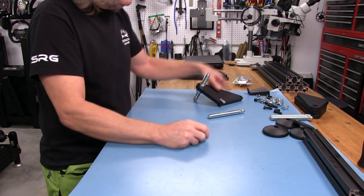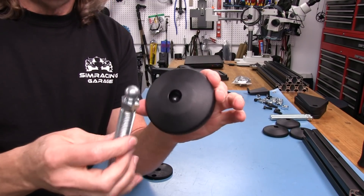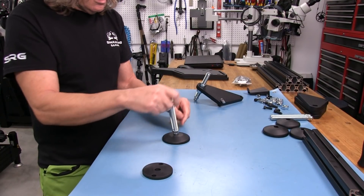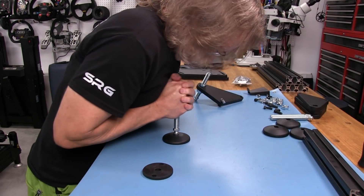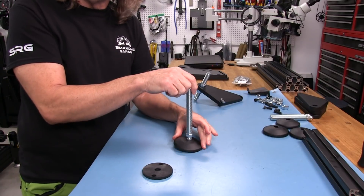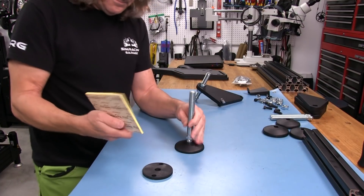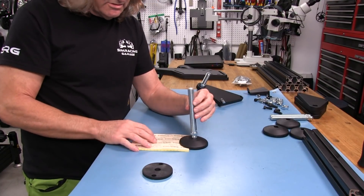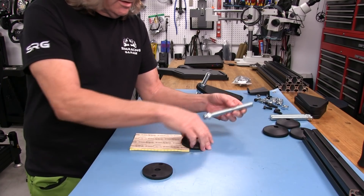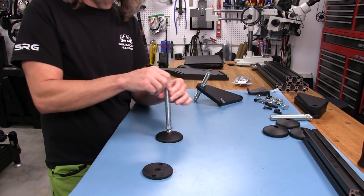Let's talk about the feet — there's a rubber piece and a plastic piece that's the top part. It interfaces with the ball at the end of the rod via a little socket. When you set it down, the ball doesn't go in right away, but once you put some weight on it, it'll pop in. The reason we have a ball joint is so that if you have an uneven or unlevel surface, this will compensate for that. Very cool — it's thinking outside the box a little bit for what feet should be able to do, almost like a motion actuator capability.